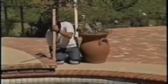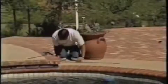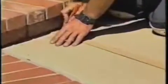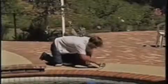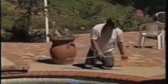First, determine your starting point. It must be where two panels will connect. Use the outer holes on the template to mark the proper distance between posts. Be sure to mark the holes a uniform distance from the water's edge. Repeat this process until you've marked the first 4 holes.